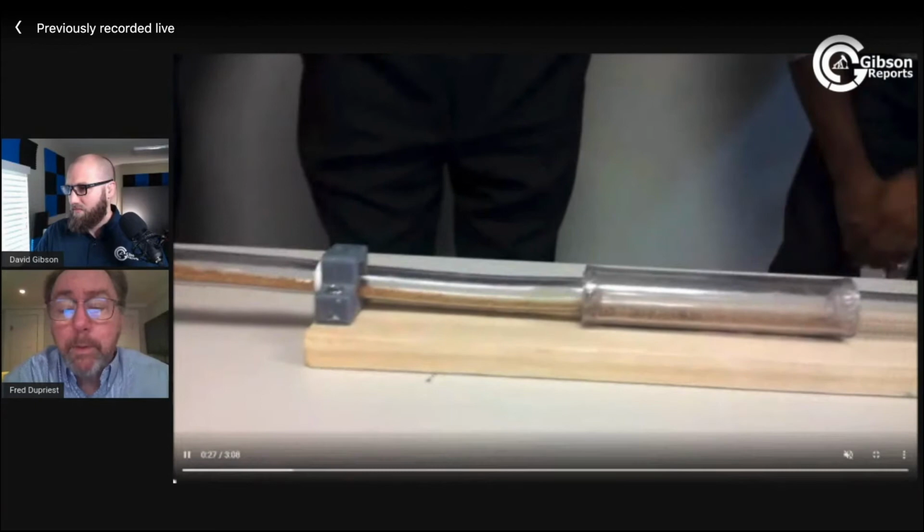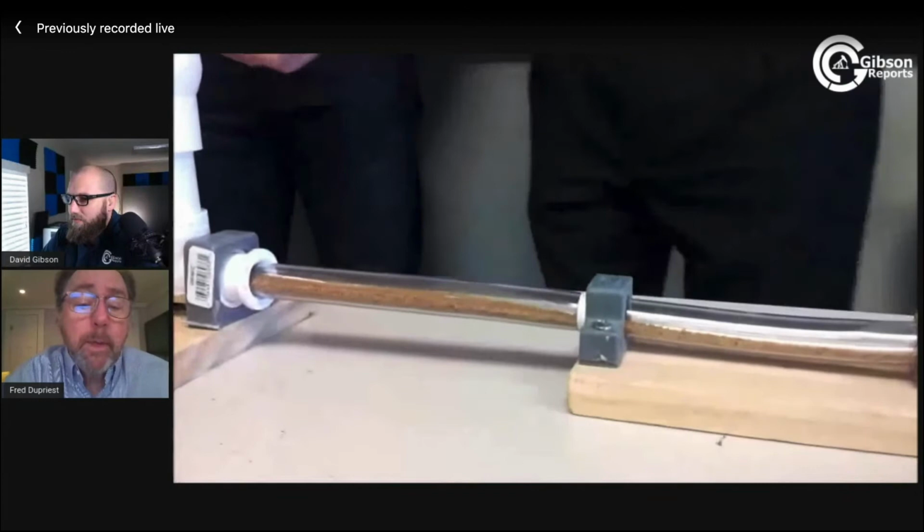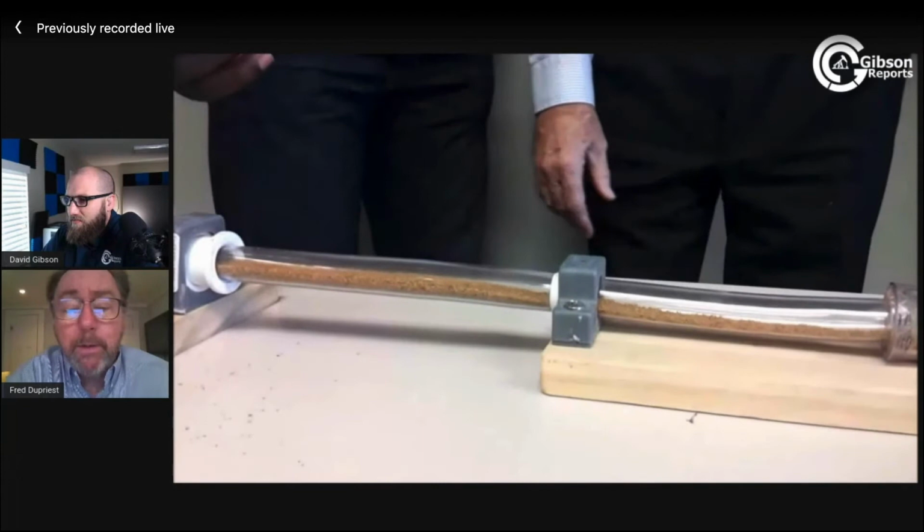Now, what happens over time here, literally in a real well, if we had a clean hole, we'd be bothered to truly clean it out and go back to drilling after a trip, is we have to rebuild our equilibrium bed all the way from the bit back to the curve before we get anything out of the hole.